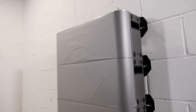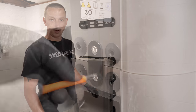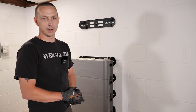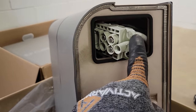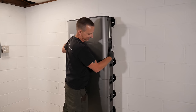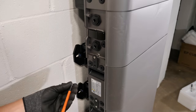Now that all the batteries are stacked and mounted on the wall, attach the little brackets with machine screws on the side — two screws, one bracket — and you do that for each one. Next is the hybrid inverter, which probably weighs about the same as a battery, so two people is best, but I'm attempting it alone. A side note: the battery cable and connections at the bottom of the inverter are loose, so shove those inside before putting it up. The inverter installs the same exact way as the batteries below it.